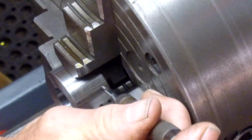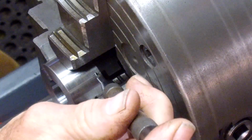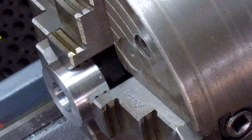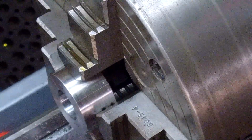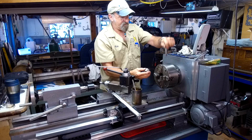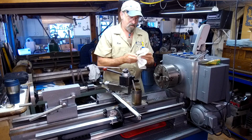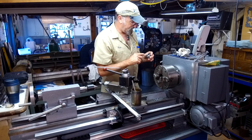Okay, I'm just going to come in on each side up here. This is our solder line right there. Looks pretty good, huh? Alright. Just going to put 1 punch there and 1 punch there. That marks the good side or the good end, and it also match marks our 2 pieces to each other. Awesome. Okay, let's go on in to the Bridgeport and put in our hole pattern here now.